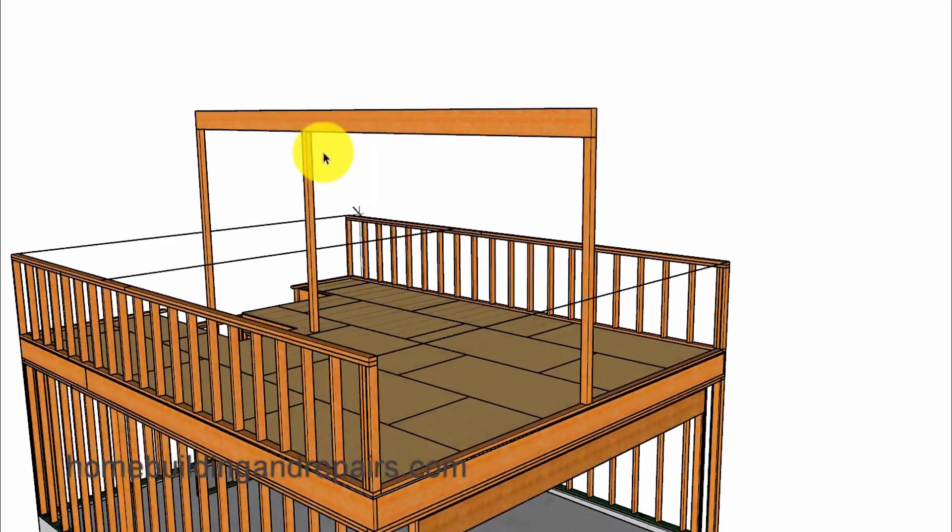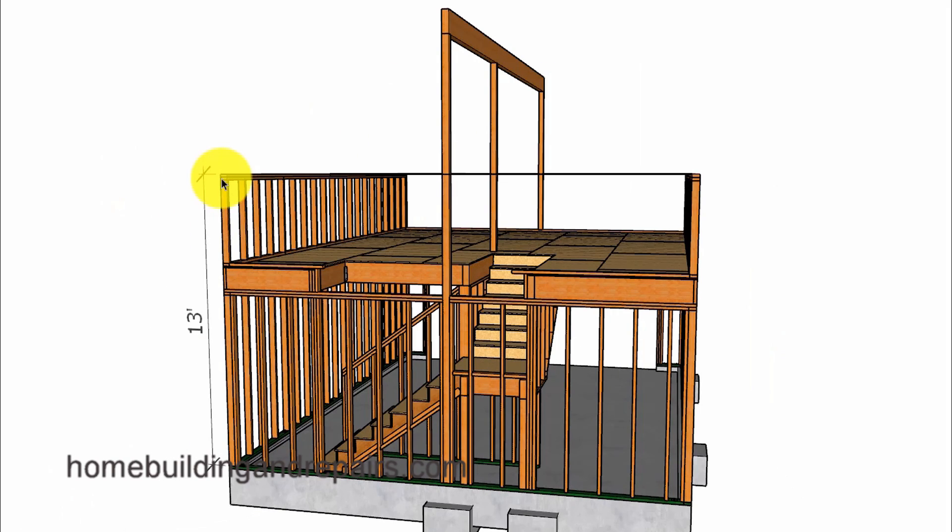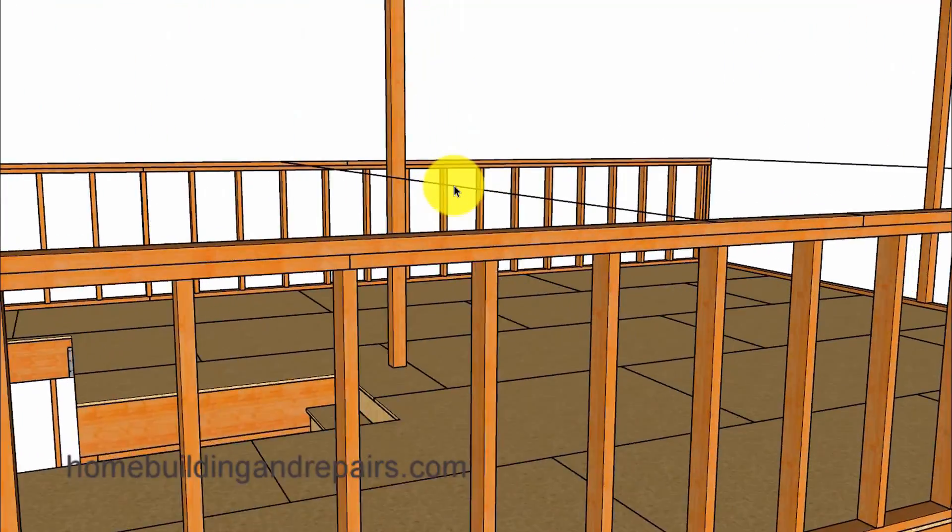To figure out the post height on the other side, all we would need to do would be to measure from the top of the framing plate to the top of the bottom plate — or the section that the post is going to be sitting on. For example, if the post was going to be sitting on top of a post base connector, then we would measure from the top of the post base connector to the top of the framing plate or the top of the string, and then add the difference we have calculated to those measurements to find that post height.